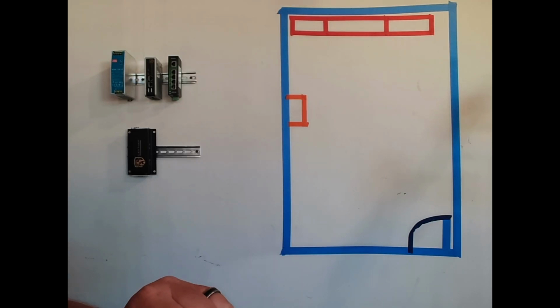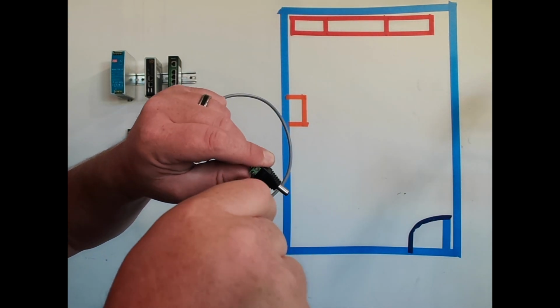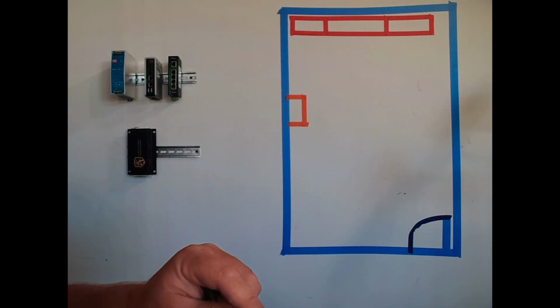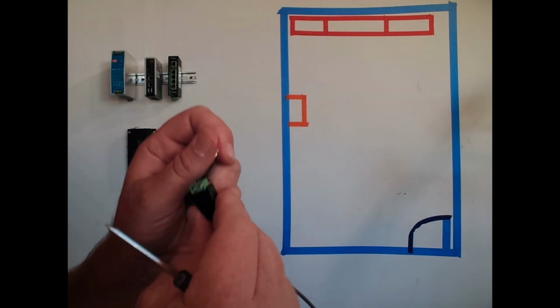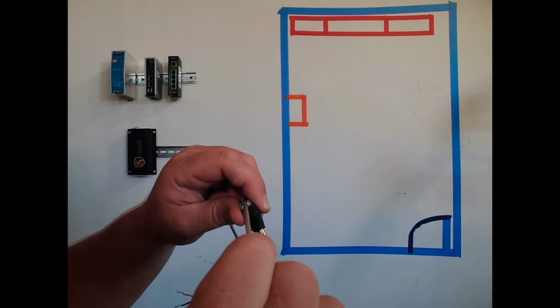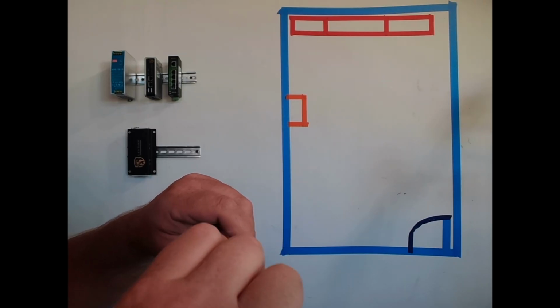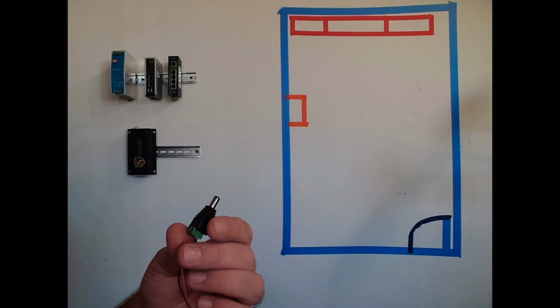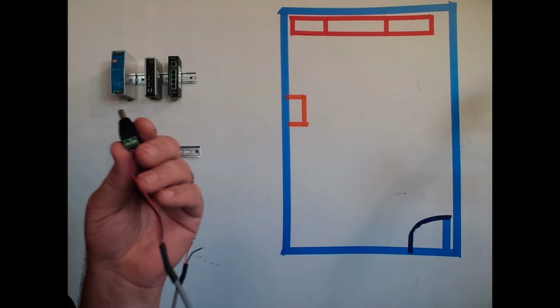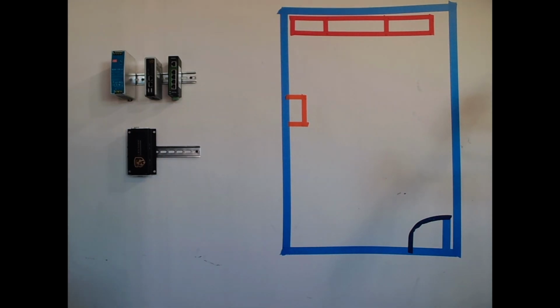So we're going to go here again. Trust but verify. Negative to negative here. Might as well do it up on camera so you guys can see, right? So there we go. We got our negative black, positive red. This is 12 volts DC. Very polarity sensitive. No protection. So we're going to tighten those up. So that is what I like to do first because I'm going to double check this specific connection multiple times through our process just to make sure that we get it right.